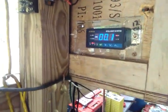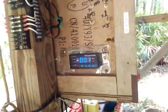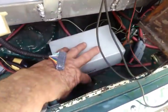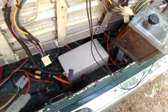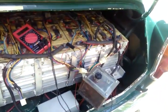What I have is a BMS inside the car which will automatically turn the car off when it gets charged. It just turned off — the car was all the way charged up. It sat a little while, and when I just plugged it in, that flicked the charger off. The charger is nothing more than this guy right here. I'm going to turn him off so that he doesn't wear down the 12 volt battery. Obviously we're charged up. There's my little BMS meter looking at the batteries — 3.72, these guys are charged.